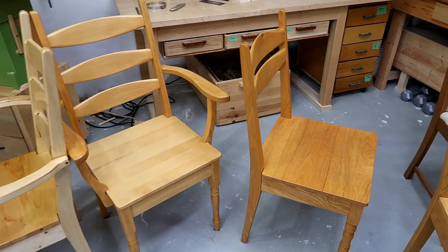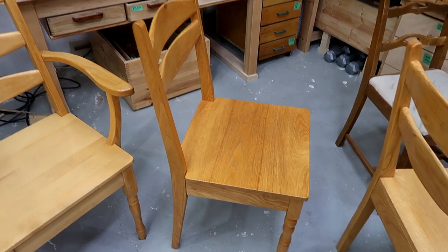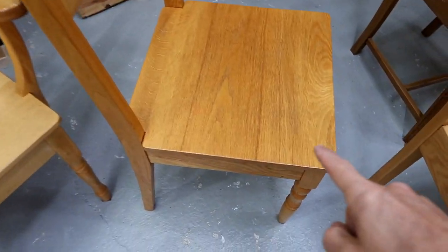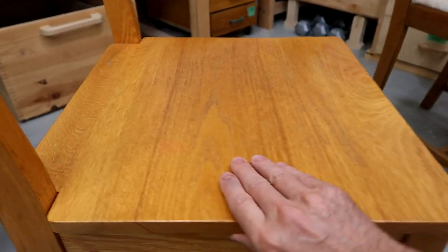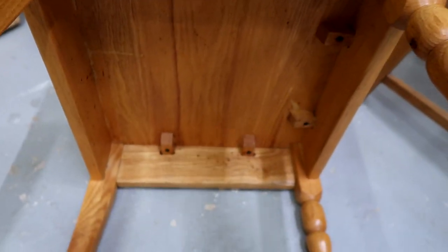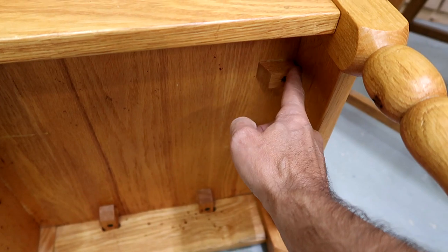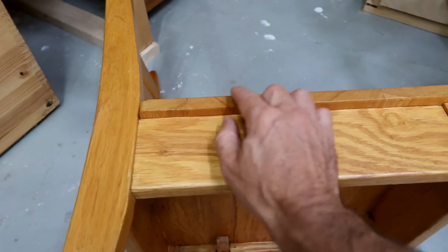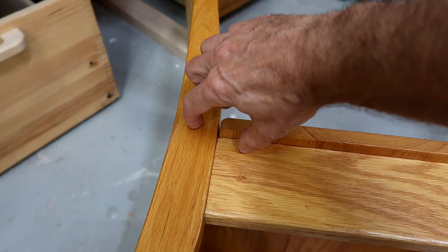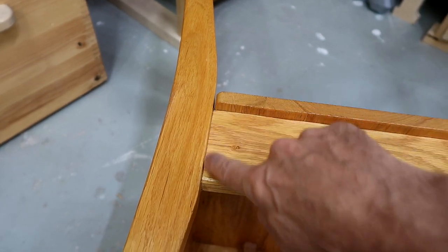I quite like how these came out. Of all the chairs my dad ever built, he always said: if it breaks, bring it back and I'll fix it. Only one ever failed, and that was in our house because it was kept in a wet basement and the top expanded a bit. My dad had left some room for expansion, but it expanded so much that the fasteners ran out of range, and the top got wider and pushed so hard against the frame that, everything being very damp, the glue softened and that joint got pushed apart.